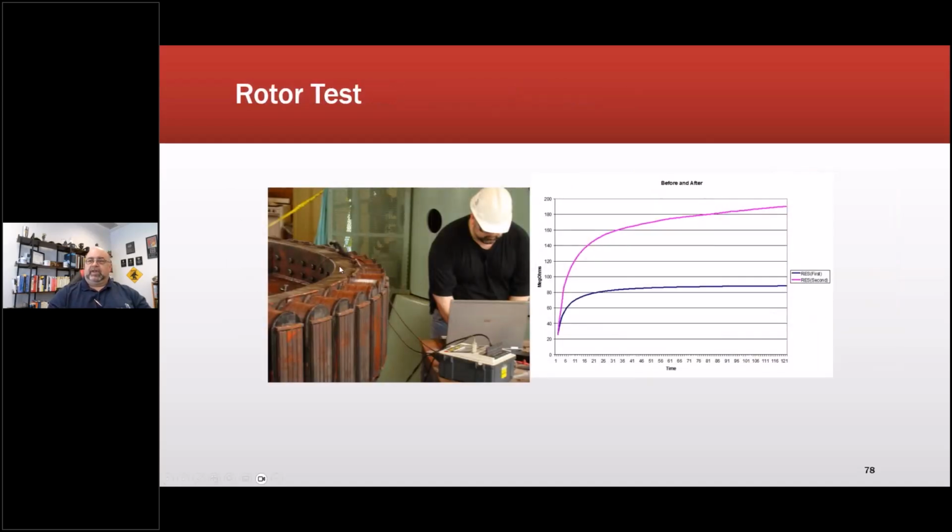Now I know that's 2010 because I remember doing this one. This is a 1 megawatt hydro generator in upstate Michigan. We were doing this in August, so everything's kind of damp. What we ended up doing here was cleaning this up manually. This instrument takes a test result every 3 seconds and maps it. I'll talk about discharges later, but we included these in the standard because somebody suggested 5 seconds, and no, it didn't work. We would miss a lot more. So every 3 seconds was the decision.